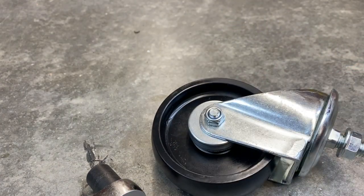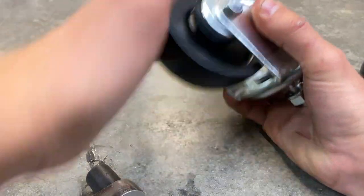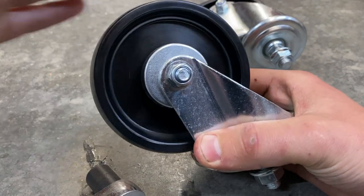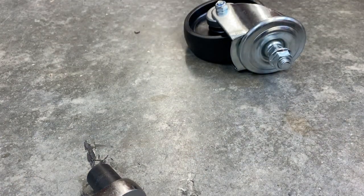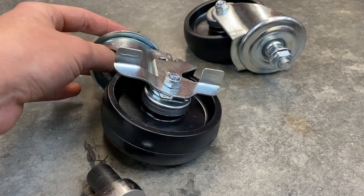It's going to sound a little weird at first — it needs to get all that grease spread around, which might take a little bit of time. You'll notice it doesn't spin as easily as the ungreased caster because there's now a little bit of resistance from the grease — see, this ungreased one spins a little easier — but under load the greased one should work better. Go ahead and repeat that on the other three remaining casters. The locking one I'll show next — it's mainly the same but I'll cover it in case you're confused.